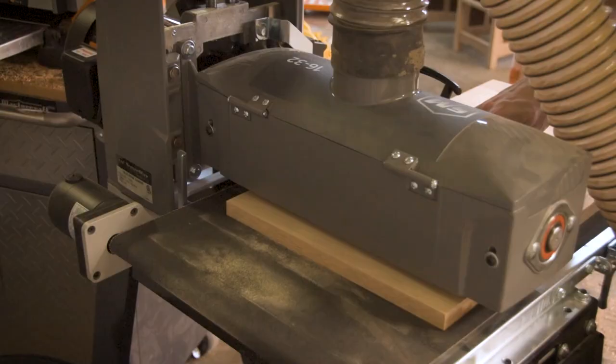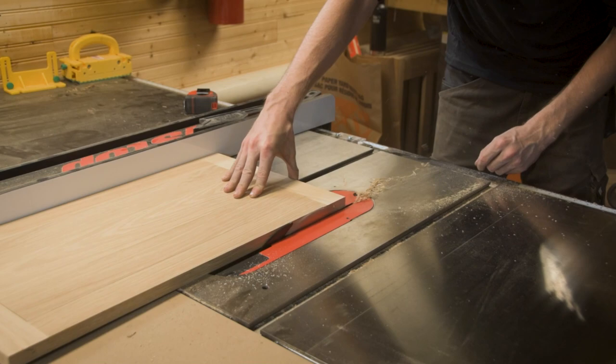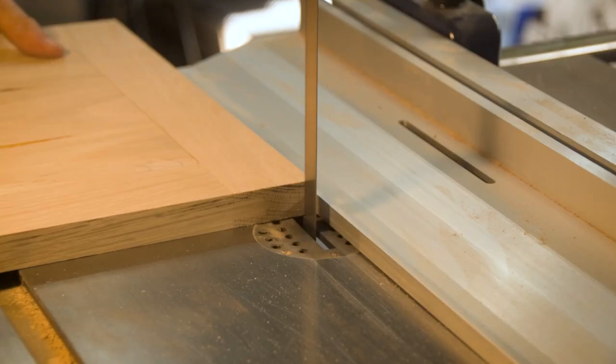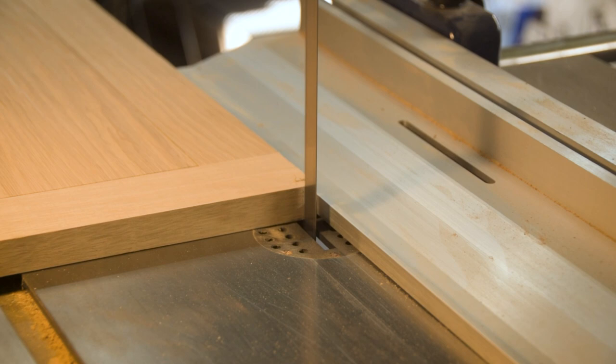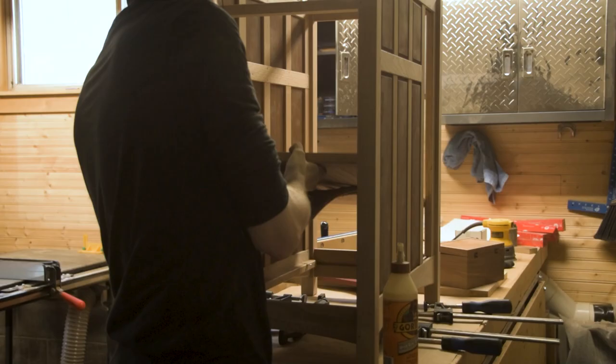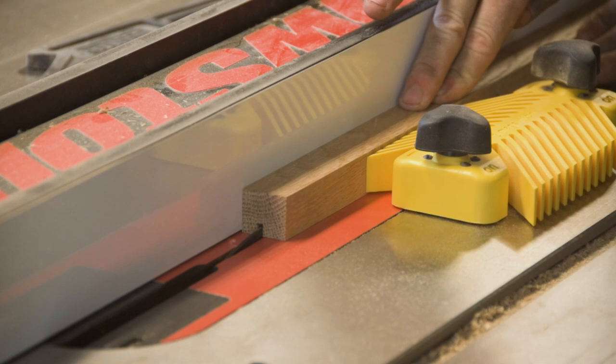This is also where the drum sander just came in absolutely handy again, because it allowed me to keep these panels perfectly flat even when they are in their finished state. I've never had this ability to keep panels like this perfectly flat. After doing a glue up, I've always had to rely on keeping them mostly flat with my palm sander. So the drum sander, again, super handy for this thing. And so both these panels just sit on the bottom on a few little tracks that I put in through dados on the bottom stretchers.